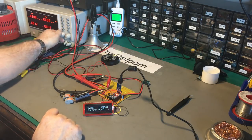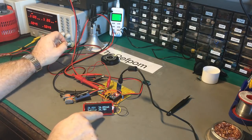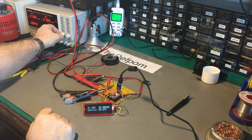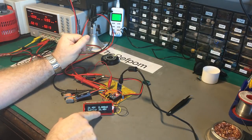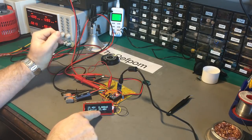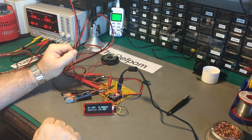Let's crank the voltage up a bit. You might see a big difference in voltage there until the current comes down. Let's drop this down - this is a 25 volt cap so I don't want to go too high. You can see the voltage dropping as the capacitor discharges, so that's measuring the voltage across the cap.